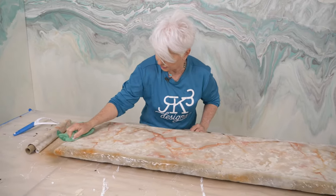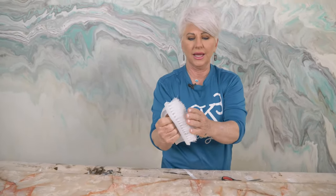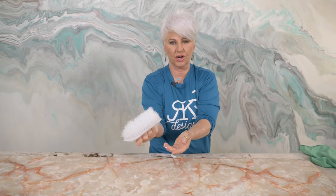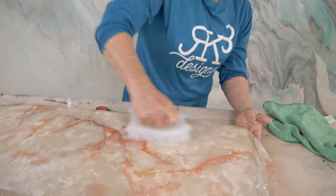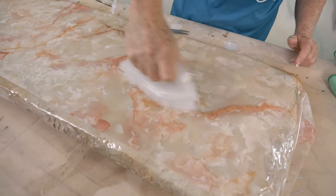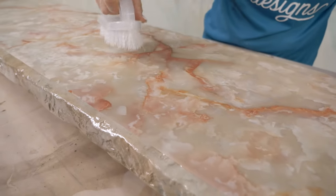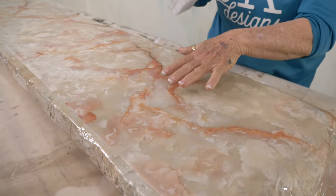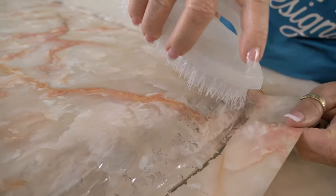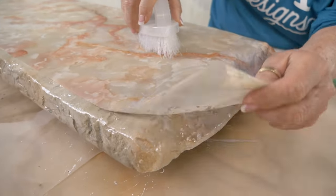I'm going to come back with a scrub brush — just a little scrub brush from the dollar store, medium hardness. Now we're going to really scrub and scratch, but what we're NOT going to do is a circular motion because that design pattern is going to transpose down into our finish, which is what we don't want. On the edge I'm going to have to lift it, push it down, lift it again so that I can really get down into those highs and lows.